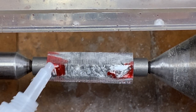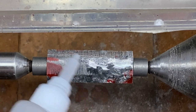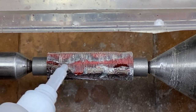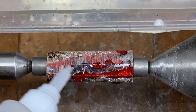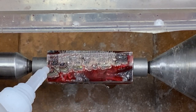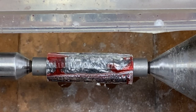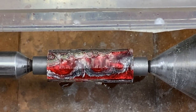Wow, that's really pretty when that CA gets on there. I'm just going to let it soak. A lot of this is resin so it's not going to do anything with the resin except sit on the surface. But since I don't know what is resin and what's actually Fordite — like this is the Fordite obviously — I don't know where it actually pokes through. I'm going to make sure that I soak the entire blank. Starting to drip a little bit onto the cardboard; I'm glad I put that there. It's going to be gorgeous when it's turned. Take a look at that red — it really pops with that different color Fordite. I want to make sure I fill that void in, so I've got quite a bit in there and then we'll make sure we get some more in there.